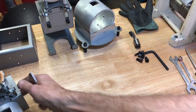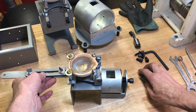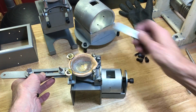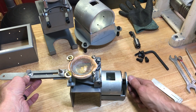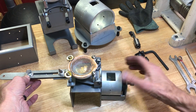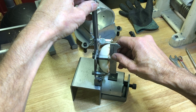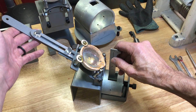We'll come over here to the Acupore. This one you don't have as much leeway to move the flask back and forth, and again these four posts are permanent — you don't touch those. What you want to do is unscrew this and center it between there, then lift that up and, just like before, check the edge of the crucible and make sure it is right at the back of the pouring hole.